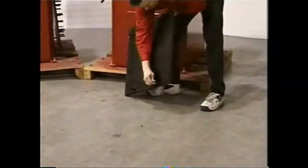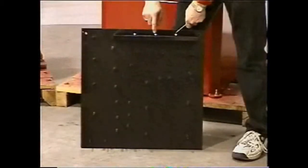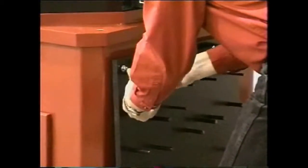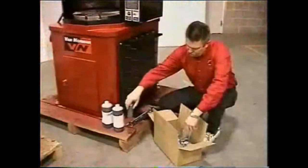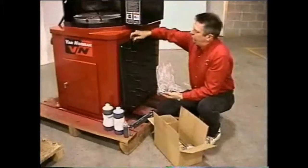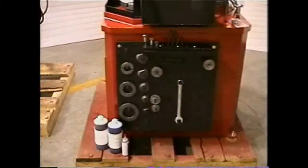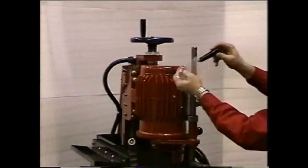Unpack the tool board and insert the two provided dowel pins into the backside of the board. Next, screw the top tray onto the tool board. Finally, bolt the tool board onto the machine. Unpack the tooling provided and place onto the tool board. Install any handles onto hand wheels or the dresser arm depending on the model you purchased.